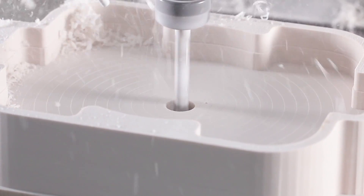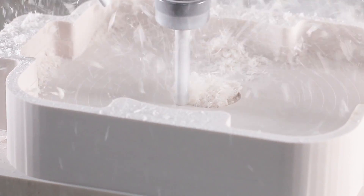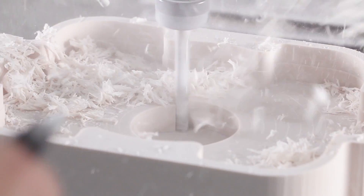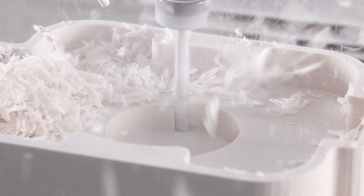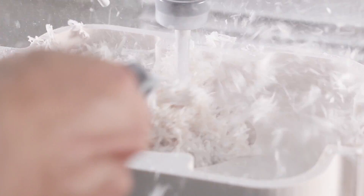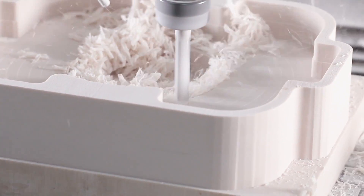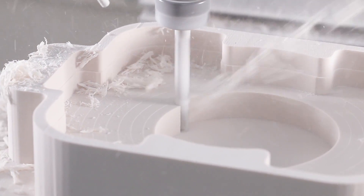REN board machines beautifully — it's so much fun. Like we talked about last week, you can make a real chip with it; it doesn't just turn to dust. If I had to do this over, I would take really just 20 minutes to build an enclosure and allow some cross airflow — blowing in one side, vacuuming out the other — to really facilitate better chip evacuation, but also for health reasons. You don't want this stuff breathed in, and you don't want dust particles from this in your machine ways, in the oil, and in the gibs.